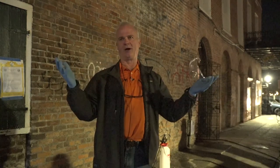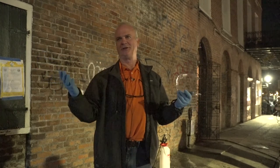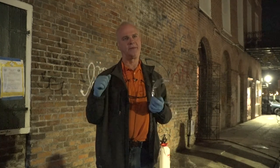The thing of it is, when you go interior and y'all have dust, everybody has it if you have brick walls. If you go in that interior wall and you put something on it that's like a lacquer or a urethane or a varnish, you're going to trap moisture behind it. It's going to blow off, and your dusting is going to increase because of the moisture you've trapped. So this product is breathable, so it's not going to trap moisture in your wall. But it's called masonry dust proofer.